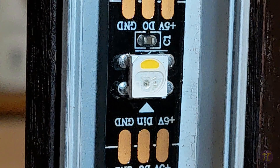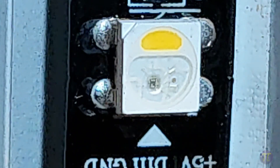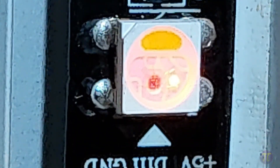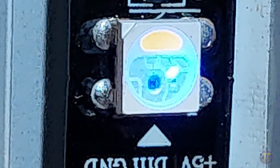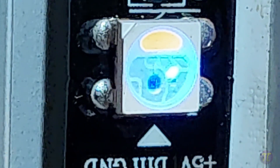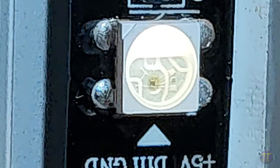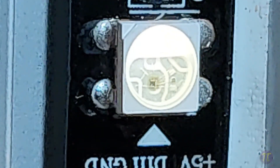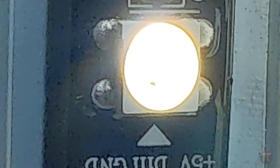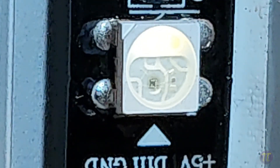Here's a close-up view of the LED. You can see the SK6812 chip, the red LED, the green LED, the blue LED, and finally the last LED is the white LED in the yellow section. You can light up any or all of these LEDs. Combined, they can make a stronger white, or you can just light up the white LED alone for a softer natural white.